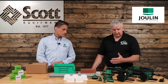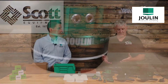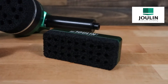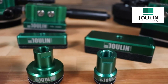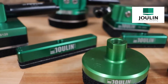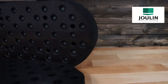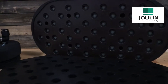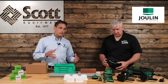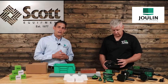Philip, I noticed a lot of different sizing and styles here. When we talk about end-of-arm tooling for collaborative robots, weight and size are obviously important. We've got several different standard components: mini grippers, flexi grips, plug and picks, and now we've even got the safe and light line, which is an all-foam gripper. It's very, very light — cuts down on your end-of-arm tooling weight so that you can maximize the capacity of your collaborative robots.